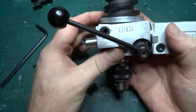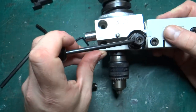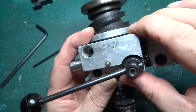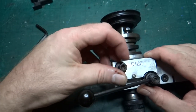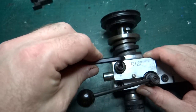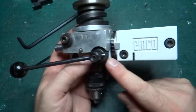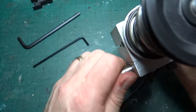Now you can see this piece is on an angle — I can still use the handle normally. But if I pull it down far enough, I can then rotate this piece down a little and you hear it click into place. That's the teeth on the knurled wheel clicking into a worm gear inside the fine feed. It's a bit sprung and tight now because it's all holding against the spring. The fine feed attachment is held in place with a bolt — a standard 5mm allen key, the same as used on nearly all the Unimat bolts. So that's now locked onto the knurled wheel, meaning the handle no longer moves freely.